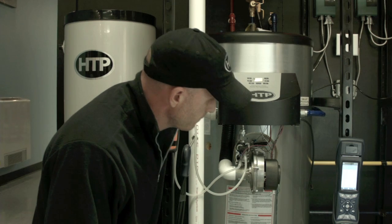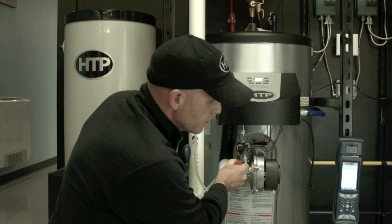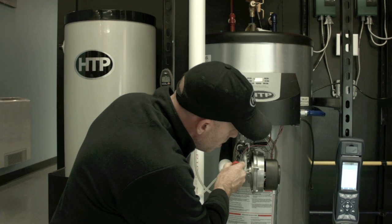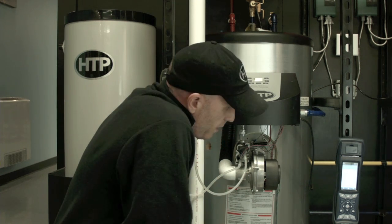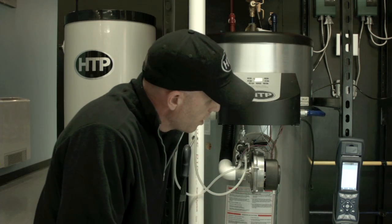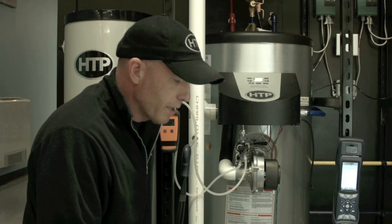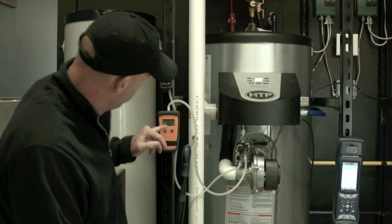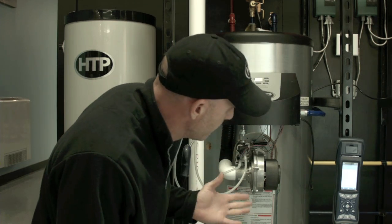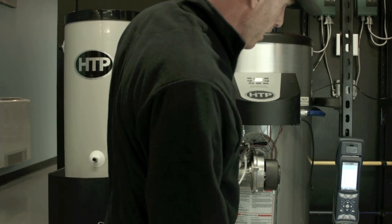We'll give it another slight turn and try to bring this back down just a little bit more. It's well within the range. This is where you feel comfortable — it runs good and lights good — we're certainly well within range. So let's give this another chance to come down just a little bit. That's coming down — 9.7, 9.5 on the CO2. Taking a look at my pressure, it seems to be okay. 9.5, 9.6 — right in that range — 10 parts per million CO. I think we're going to be okay with high fire.